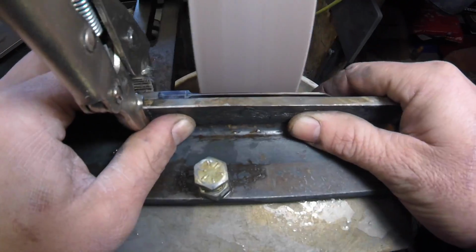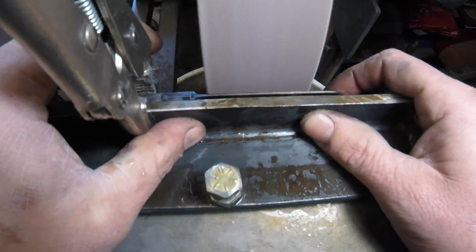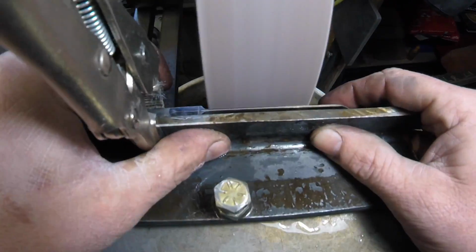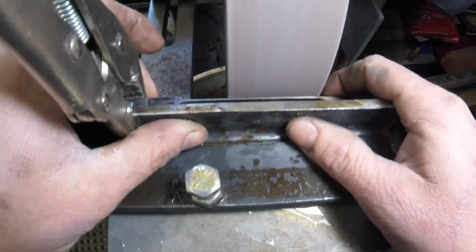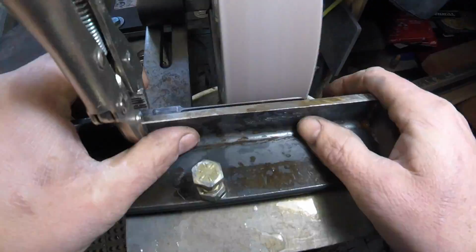Now with the Tanto knife, you want a different angle on the tip, so I am just doing a perfectly straight grind, and then we'll come in later by hand and grind the tip, and that will be a flat grind. It gives it a little bit more strength for stabbing and a little more tip strength, but you still get that really nice fine edge with a hollow grind. And it looks pretty neat when it's done as well.